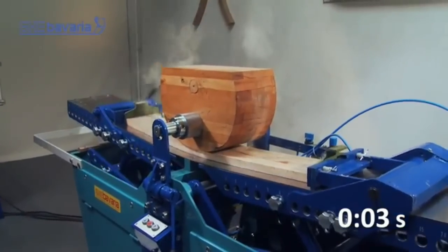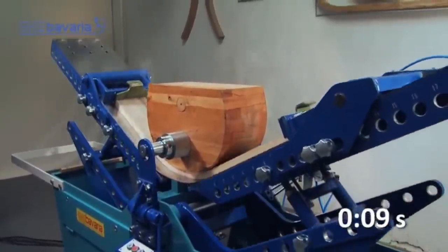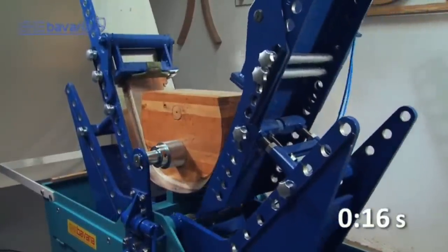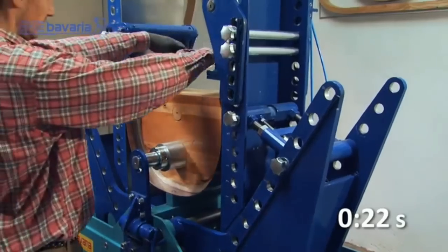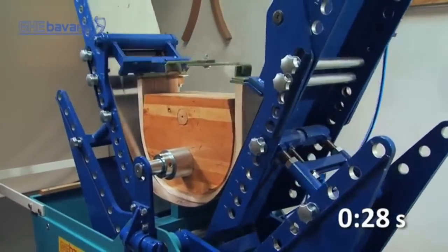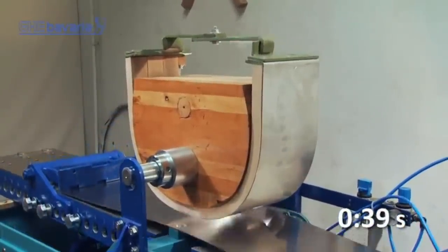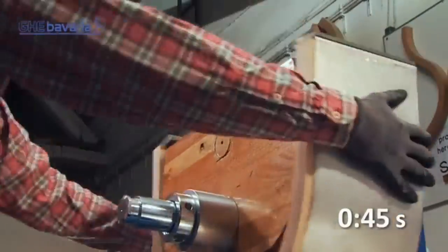Selectable bending speed, automatic longitudinal pressing, and independently adjustable limit switches at the touchscreen operator panel are extended standard equipment. The machine is driven by two independent geared brake motors. The center press and longitudinal pressing switch in automatically; when reaching the end position, the machine stops on that side. Straightforward return of the open bending beams is possible even for large bending angles.